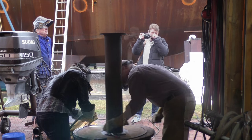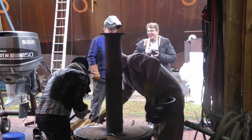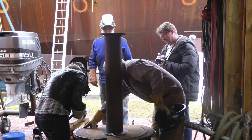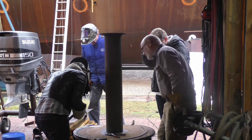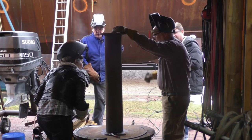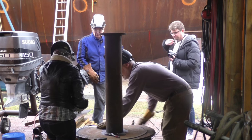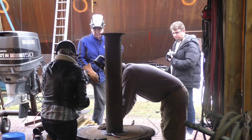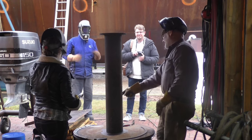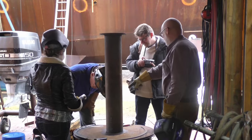What I want to do is try to see the puddle of the metal and go again. This is where I was controlling your speed — you're doing it a little too fast. I got you to slow down too much. That's all there is to it. You want to go back over it? Yeah, you can go back over it, just start here and do the whole thing. What you're not doing is you're not watching the puddle — you'll be able to actually see the puddle come up on top. That looks a lot better than the first one. Twenty more of those and you're up to tape quality.